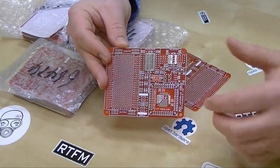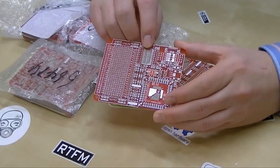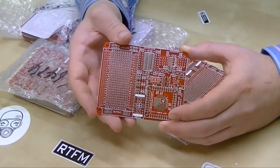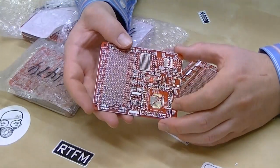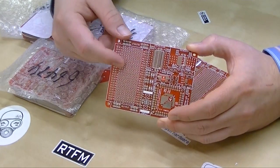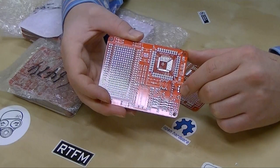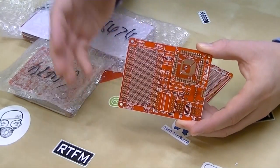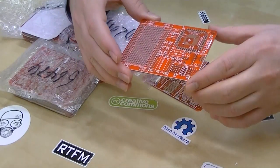There's a footprint for a QFP chip, and that could be an ARM, an AVR, a PIC, MSP430, whatever. We've also got an SOIC footprint, an SSOP chip footprint, and then all sorts of small footprints for USB, surface-mount components like capacitors, resistors, crystals, buttons, LEDs, and then a large through-hole prototyping area. New in version 2, in addition to the extra QFP footprint on the back, we added a USB micro connector, as well as put the whole board in the standard Sick of Beige format. That way it can be used with one of our cheap acrylic cases once you finish your circuit — you can put it in a sandwich case starting at $3. Version 1 is currently around $10, and these will replace it as it runs out.